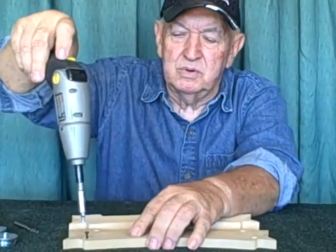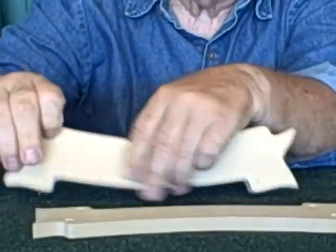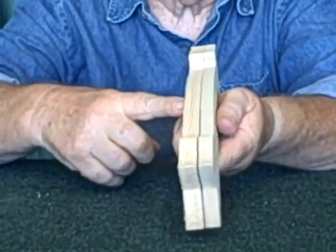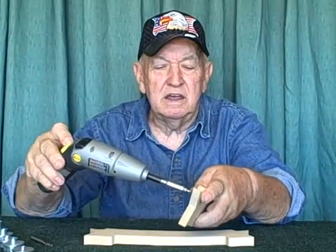This is a pattern screw, and we use these so that when they're in place they hold the patterns to the wood. That's what I want to show you on this video, so go back and watch video number seven and you'll see everything you need to know to cut these shapes. We'll start by showing the router base and how we hook up these template guides to the router base.